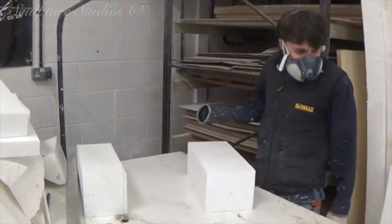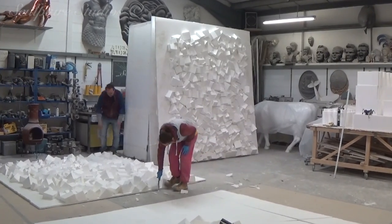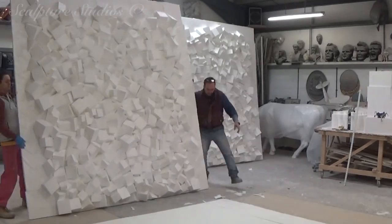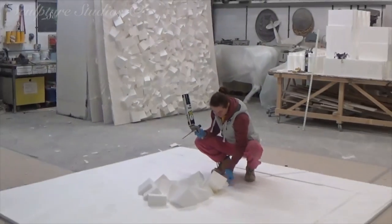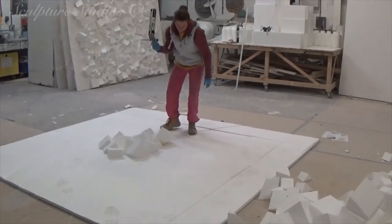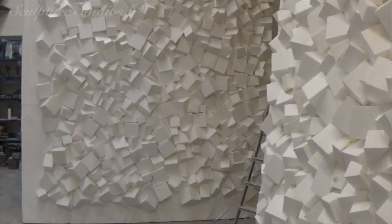As the polystyrene surface is now much bulkier than the initial sample, we're keeping the sheets very thin so as to save on the overall wall depth becoming too thick. This looks very flimsy at this stage, but the main bulk of the strength comes from the cubes being bonded together on the surface and the render that's going to be going on top. Remember that these are only the wall cladding going on the wooden box walls — they aren't the actual walls themselves.